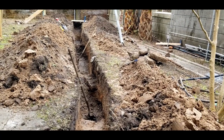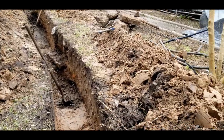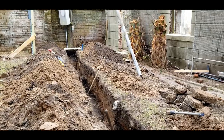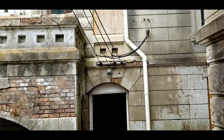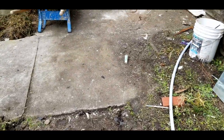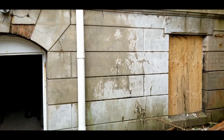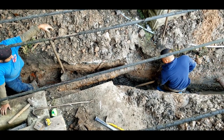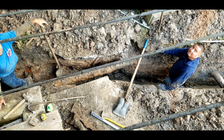So this is happening today. The guys have been digging — they are so fast, they've done this in probably two hours. Fortunately, the soil down here is sandy and not clay. This is for the direct burial of the new electrical service coming in so we can get rid of these overhead lines — they're so close to the ground you can reach up and touch them. They still have to go through the concrete and then come out by the drain and mount the meter can. It was a relatively short run to dig, but we always dig by hand because we always find things in the ground that we don't know are there, and we don't want to accidentally cut through anything or do any damage.